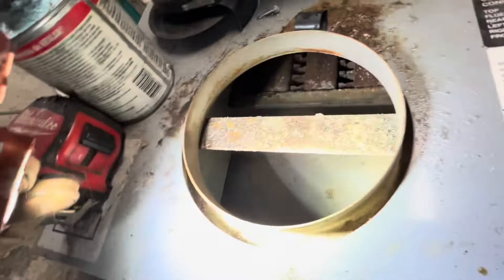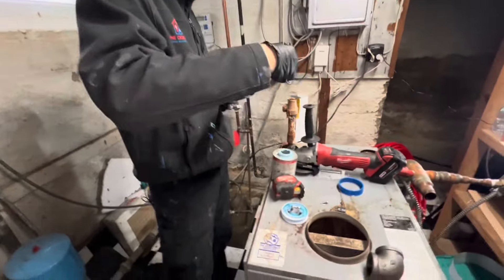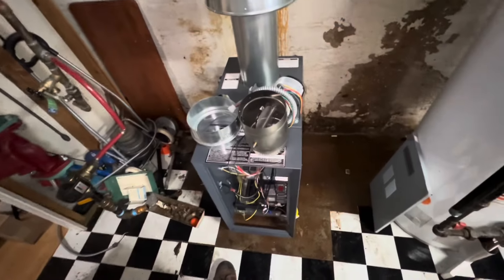You can see how filthy it is in there — let's see if I can get my light in. It's not terrible, but this will be nice. So Peter's getting our riser set up; it's going to come out of the top of the boiler and hold the tridicator gauge, right there. I'm working on the exhaust, which looks like it's going to be a perfect fit with our vent damper and our reducer. I just wanted to record this — all modern vent dampers come with these two pieces. You can see one has a hole in it and this one doesn't. This is a direct spark ignition, so it doesn't have a pilot 24/7. So you use this plug that completely blocks off the hole. But if you had a pilot, you would put the one with the hole in it, so the pilot can exhaust out from the venting.